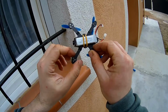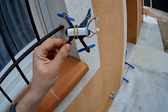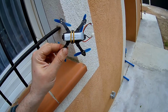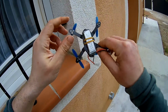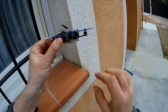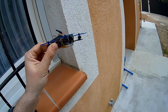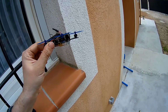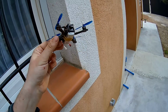And I would say the two other negative points are about the battery. This one, as you saw immediately after the takeoff, a huge massive drop of voltage under load is observed. More than 1 volt is completely unacceptable. The 30C of discharge rate is probably fake or false, and I found the camera light sensitivity is not impressive, and I had some problems flying under some trees and so on, so I'm not impressed by the light sensitivity quality of this bundle.